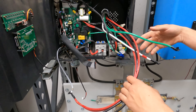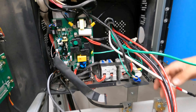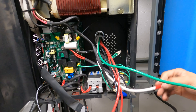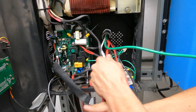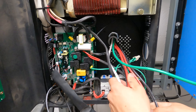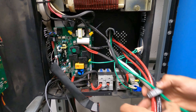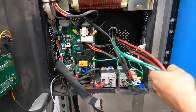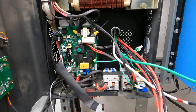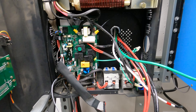I've got all these wires disconnected. Previously I had some zip ties by the connector to identify which were which, but since I need to pull all these wires through that connector, I put a red piece of electrical tape on these three wires — those were the power out that goes to the panels — and then the two without tape were the generator feeds. It's definitely important when retrofitting an inverter to identify all the wires. There's a good chance we're going to replace all this wire because I'm not a fan of splices, but still keeping in mind what was what so when you put it back together you have it connected right.